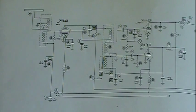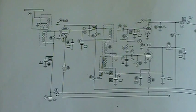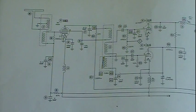So how do you do that? Well, it's real simple. You tune in your radio frequency. You still have a tuned radio frequency circuit on a radio, just a capacitor across the antenna coil, making a tank circuit that resonates at the right frequency wherever you tune it. If there's a radio station there, it allows it through. Everything else gets blocked. You feed that into a tube called a mixer or converter or translator or first detector. There are a lot of different names for them, but it basically mixes signals. You have a local oscillator on board the radio or TV, and that also is tunable.